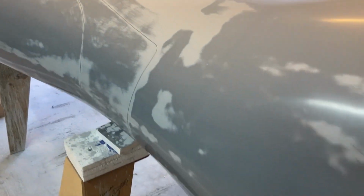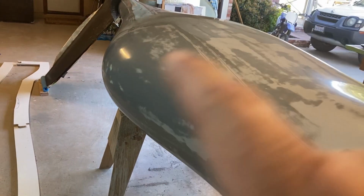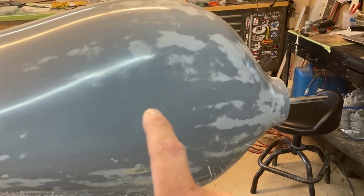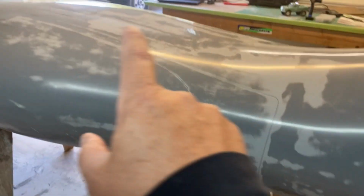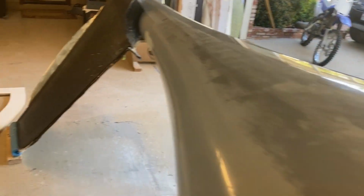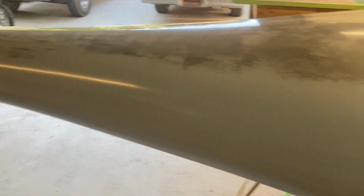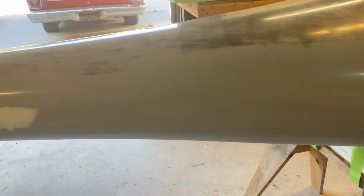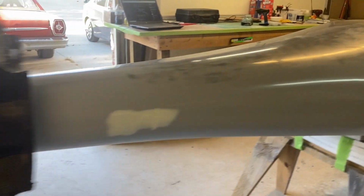Most of the plug had been molded before, so the only things that I haven't molded yet are the left and right fuselage halves. I've already pulled a canopy mold, and upper and lower cowl molds. So a good portion of all of this was already sanded and polished, so it really wasn't a whole lot of work. Basically I just sanded the whole thing down. There were a couple spots that needed a little bit of filling, a few pinholes and things like that, but nothing major. So I sanded it down to 2000 grit and polished it, preparing to put on the splitter plates.